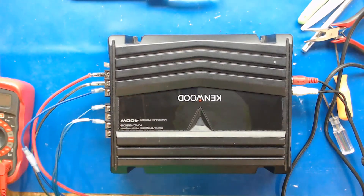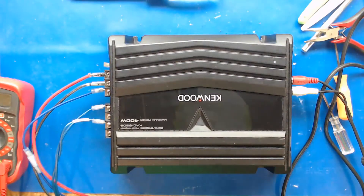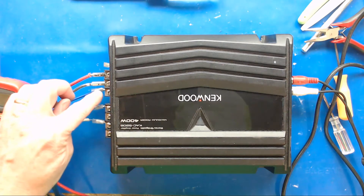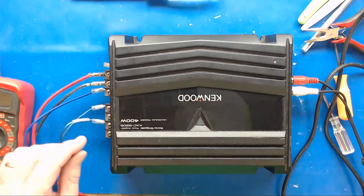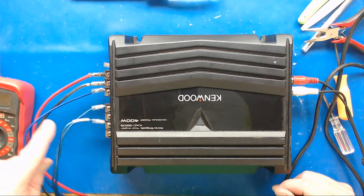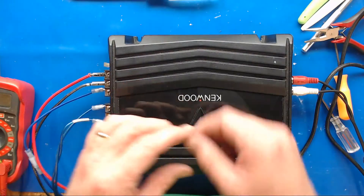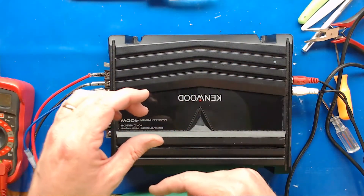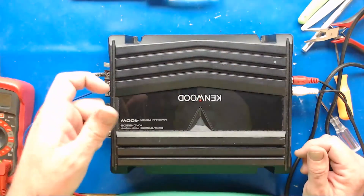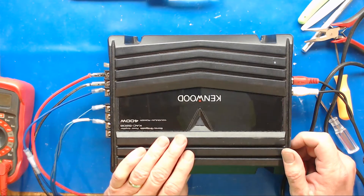Turn on my power supply. My remote is through a foot switch — you never jump from the power straight over to power up these amps to test. You're going to be taking power from your power anyway, but get it through somewhere separate, through either a little toggle switch or a push button, which is actually better. Push button while you're holding it acts as the remote, then you can let off really quick. It's the same with the foot switch that I have down at the bottom — I can let off with my foot real quick.